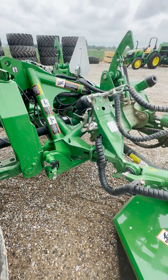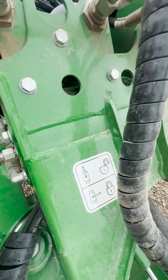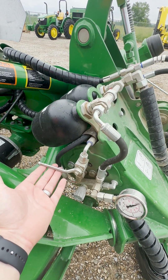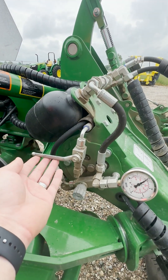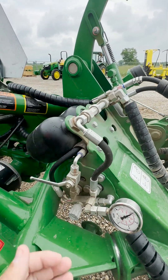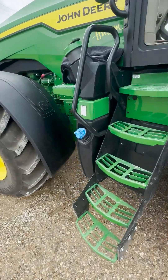If that mower needs to be adjusted — right now we're on the left-hand mower — what we can do to adjust this pressure: you'll see here that there's a diagram to unlock and lock the actuator. What we have here is that valve that we need to change. Right now it is locked to the right. In order to allow us to change this pressure, we'll take this valve and push it all the way up so it's straight up and down. Once we have that adjusted, we will go up into the cab of the tractor to adjust the pressure.